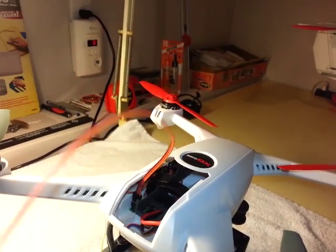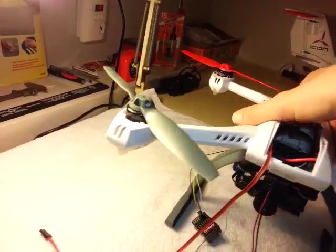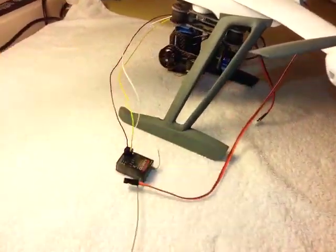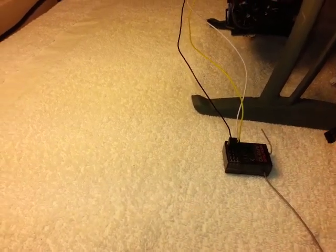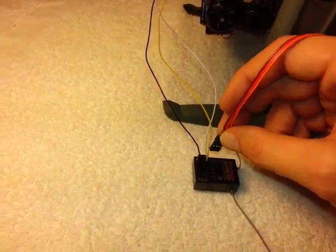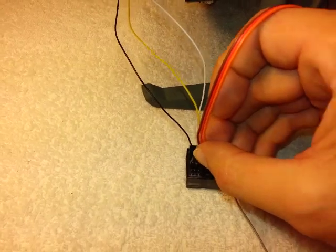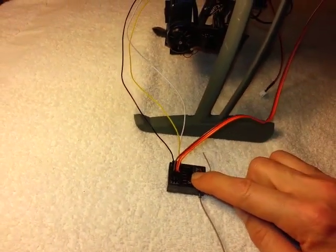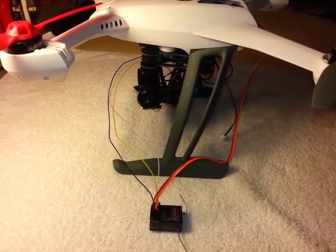So I just made up a jumper cable. I measured it, it's right around 5 volts, maybe just a little under, but it is a servo output. So all we do now is take our old Spektrum receiver, or any 6-channel receiver, and, stealing power from the board on the 350, you can plug this into I guess any of them, because all that's important is getting power to the unit. So I'm going to select the rudder input, and like I say, all this plug is for is getting power to the unit. So I'm going to pause again, connect the battery, fire everything up, and show you the end results.